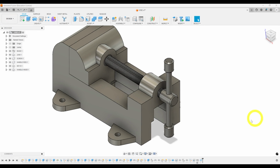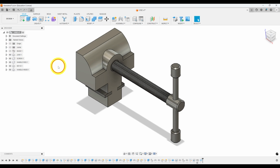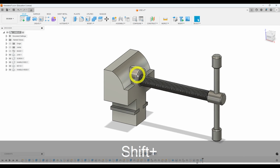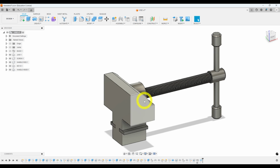Welcome everyone to our next video tutorial where we are going to fix the screw here and make it more realistic so that it attaches to the jaw properly. So let's go ahead and get started. We are going to hide the base for now because we don't really need it. And we are going to first start by making the hole go all the way through the jaw to this other side, and then we're going to make a larger hole here. We're going to attach the screw with a retaining ring on this side so that it helps it move back and forth.